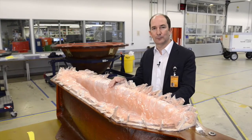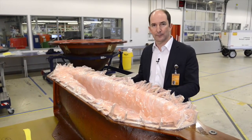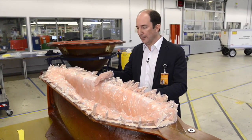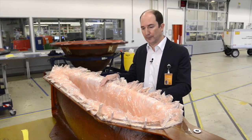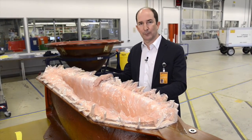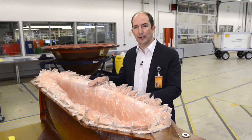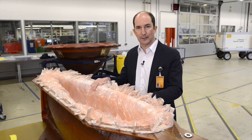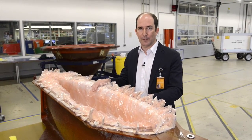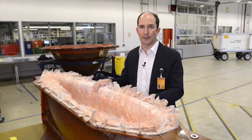You've just seen my colleague Michael putting the prepreg material into the mould. This is the TEOS mould — the mould for the radome itself. In here is the prepreg material, and on top of it is the vacuum bagging material and also the fleece which supports the vacuuming process. We won't go into detail on the actual lay-up here because that's a little bit of a company secret — it's what provides the structural soundness of the radome and the transmissibility for KA, KU and L-band antennas.